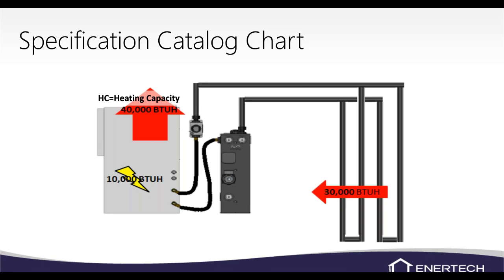You can figure out heat of compression in the field: volts times amps equals watts, then multiply by 3.4 to get BTUs. With that number you can calculate the COP and EER — the efficiency of the unit. If a homeowner says they're getting high bills, this calculation is the first thing we'll do to determine the unit's efficiency, whether that's COP in heating or EER in cooling.